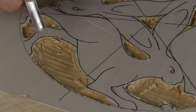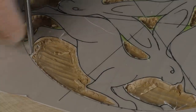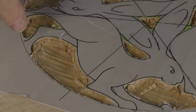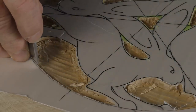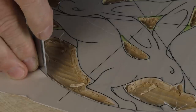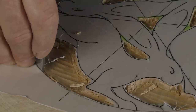I'll swap to another tool — perhaps this one will match this curve here — and stab that one in like this, coming around a little bit so nothing breaks off. Then I might find one that'll fit this slower curve here — it's probably better sliced. You find a tool that fits and go straight down, then come into slicing: shunt the tool along, push it down, shunt it along, keeping exactly on that line. Don't think about the bevel or the angle — think about this wall coming pretty much vertically. If anything you're going to slope it out slightly to get a little bit of light.